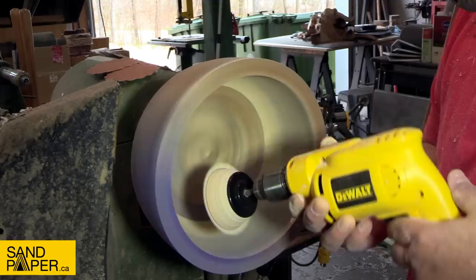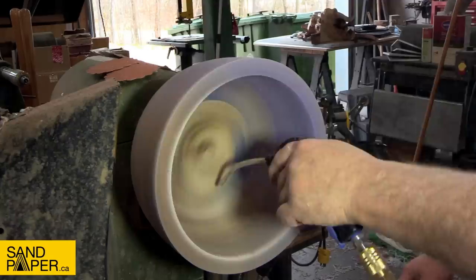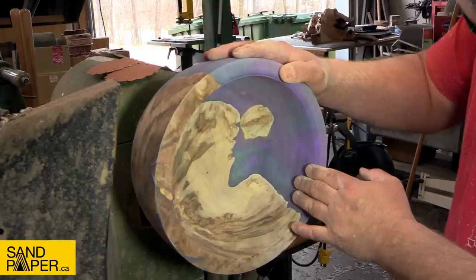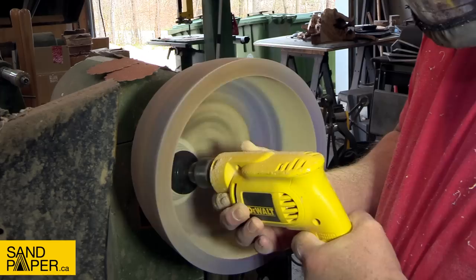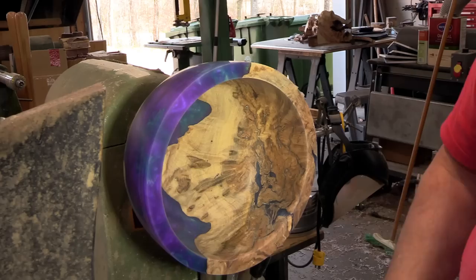Like I do each week, I start at 60 grit, and on pieces like this, I'll typically start at 60 grit, go to 180, then there'll be some sanding dust left over, like you'll see right there in the bowl, and I rub that all into the surface of the bowl, and then I'll hit that with the thin Starbond again, and then continue sanding from 180 to 800.